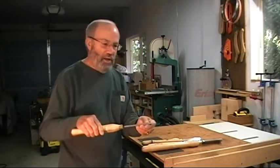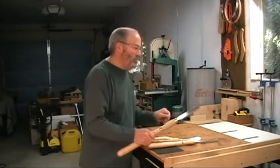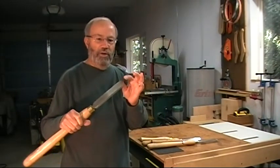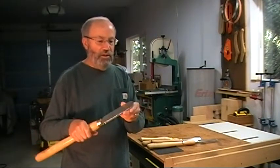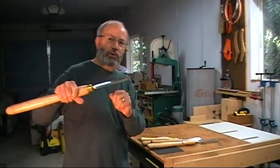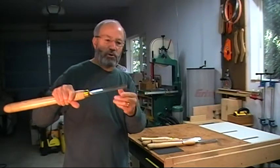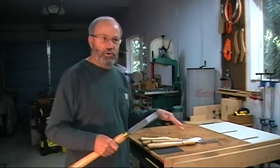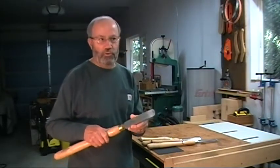On the other side you can get close into a square corner. The actual cutting part of the scraper is formed by a burr on the very edge, and that's formed naturally in the sharpening process. I generally grind my edges to about a 70-degree angle — that gives me a little more angle to get the burr onto. I have the same angle on all my scrapers, so it's quite easy to go between them on the sharpener and on the lathe.